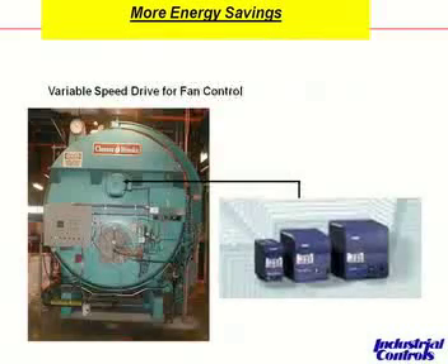As mentioned previously, here you have pictures on the right — I apologize for their clarity — showing VFDs ranging from smaller to larger horsepower, focusing on the combustion air fan. You can also see the actual small FireEye display mounted in the gray control panel on the far right-hand side of the picture.